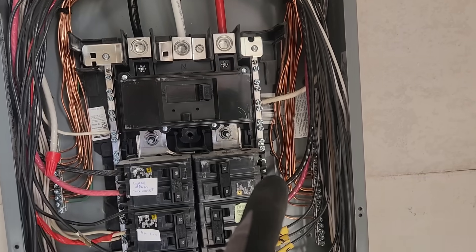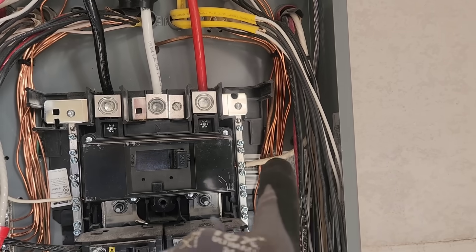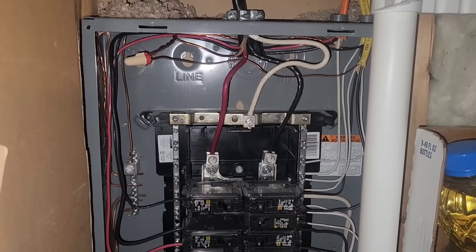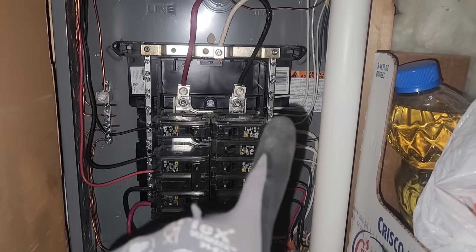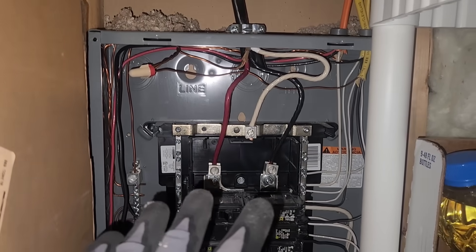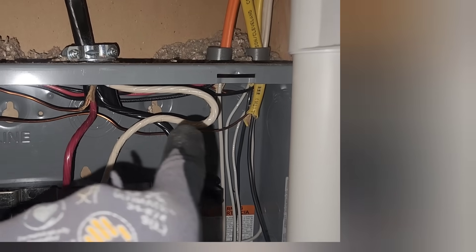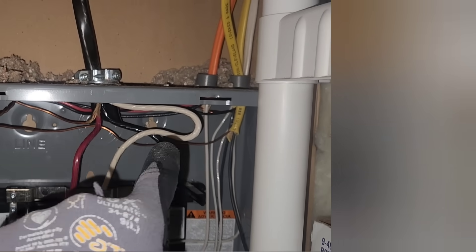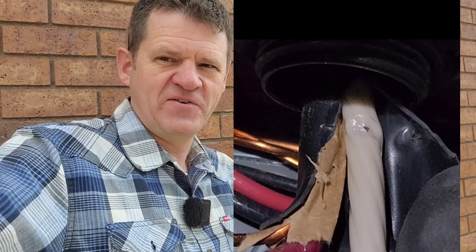My third and final ground neutral bond was from a really big wire, which is actually the feeder wire into the subpanel I have in my basement. None of the circuits in the subpanel had a ground neutral bond. What happened was whoever installed the subpanel tightened the heck out of this wire clamp, and it was actually piercing the side of the neutral wire so the neutral was touching the frame of the electrical box. Once I fixed that, I only had one ground neutral bond in my entire house.